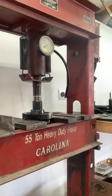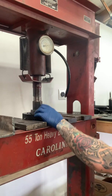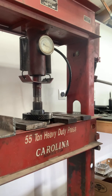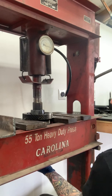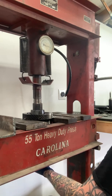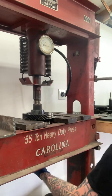I figure you guys might want to watch. This is an old leaky Carolina 55-ton press and there's a gauge right here — you'll see how far we've got to wind it out. Once it starts moving, especially if it's really oily, you can switch speeds. I've got a two-speed valve over here: one side is lots of force with very little speed, and then there's a larger bore that gets a little more speed going but doesn't have as much power behind it.